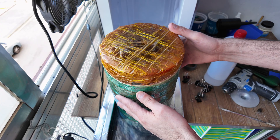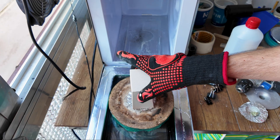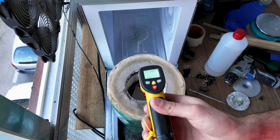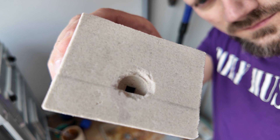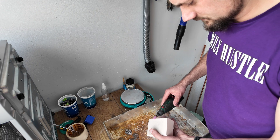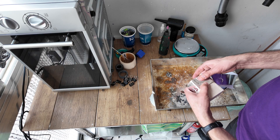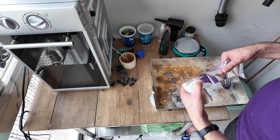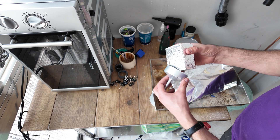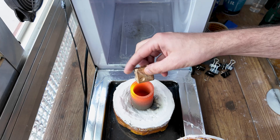After that I used my microwave kiln to burn it out. I like to collect the molten plastic in a tray instead of burning it. The mold reached almost 450 degrees Celsius. It's the next day — the mold has been burned out and I'm just enlarging the opening where I'm gonna pour the metal. I'm gonna cover the mold with aluminum foil tape; it can help to keep the mold together in case it cracks. I'll also pull some vacuum even though I don't think we need it. I'm gonna melt some bronze.